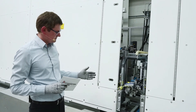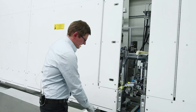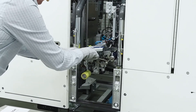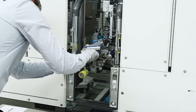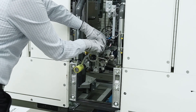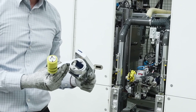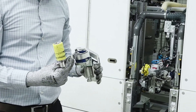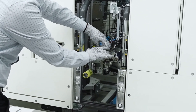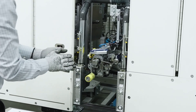The complete unit is very easy to remove, which needs to be done for example for stepped units. The first step is to move this main part backwards, and then we take the nozzle away. Finally there are two mechanical locks to release, and now I have the corner refiner in my hands — that's all. It's very easy and comfortable. In the same way we can put it back onto the sealing head using the same procedure, and finally we take the nozzle. So now it is ready again.